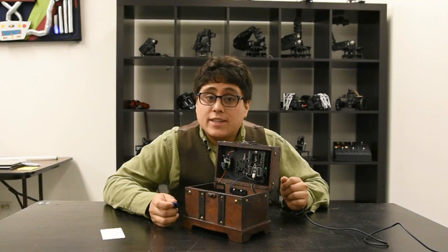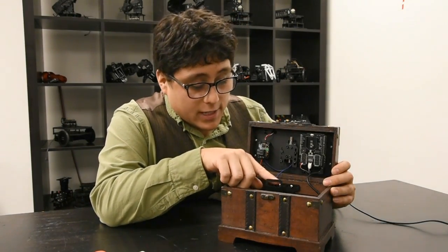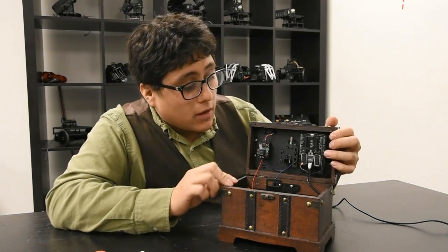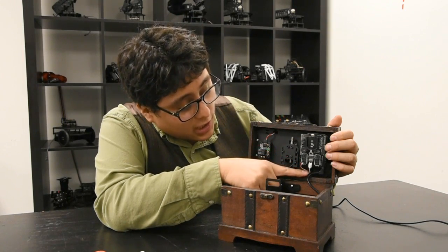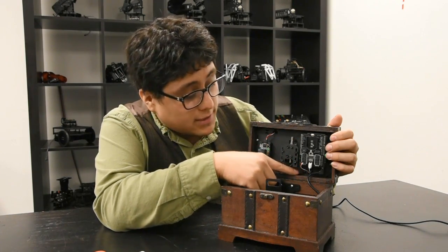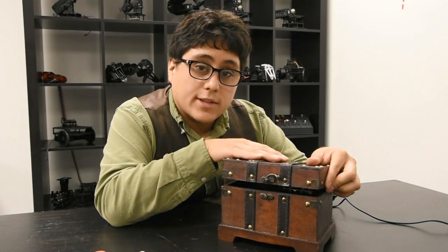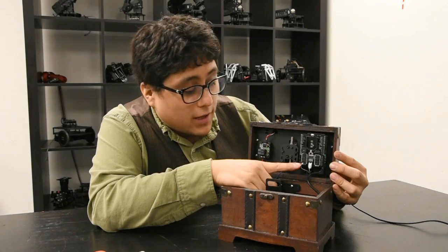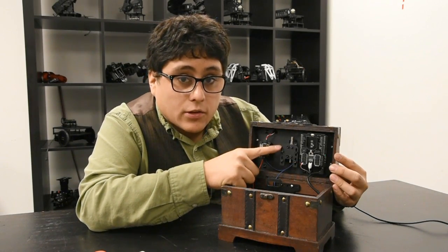Let's take a look at everything inside of the box. We have all our mounting plates, a plastic latch plate, and a mounting plate for all of our electronics. At the heart of everything is the Geek Duino and the RFIDuino shield. One cable goes back to the antenna — the antenna is behind this black plastic plate, which keeps it as close to the top as possible to increase read range. We've got a single three-pin Robot Geek cable going to our relay, and our relay is going to control the solenoid.